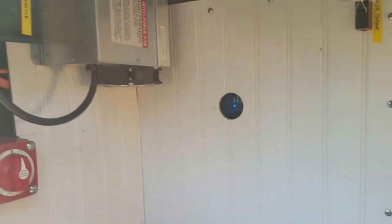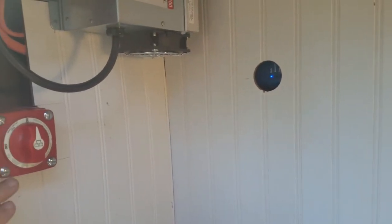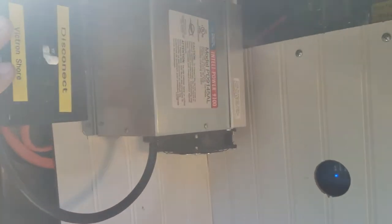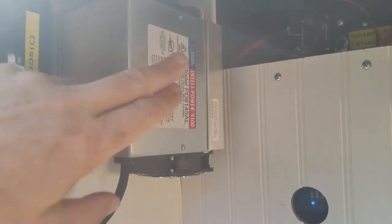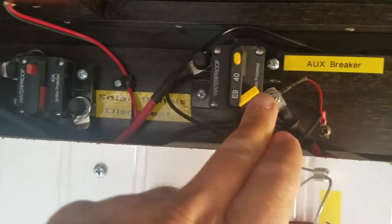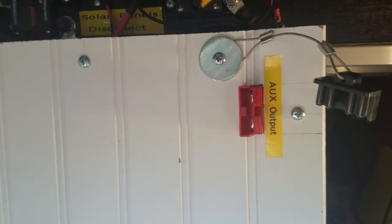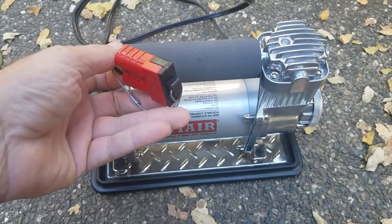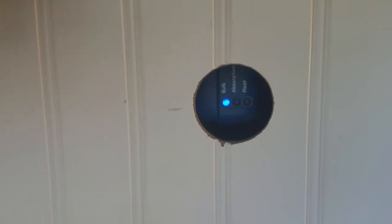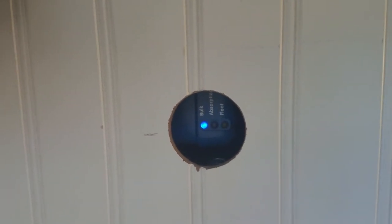As I bring you here into our little cubby, you really don't see too much going on in here because it's behind the panels, which I'll remove in just a second. But what you do have access to is a battery disconnect switch here, a charger disconnect switch which will disconnect you from the AC, the charge unit, a solar disconnect, a utilities disconnect, and a utility plug which I've made so I can plug in my air compressor. You can see a little blue light and a little window, and currently it shows that the solar is doing a bulk charge because it's still early in the morning. That would be the status LED of the solar system.